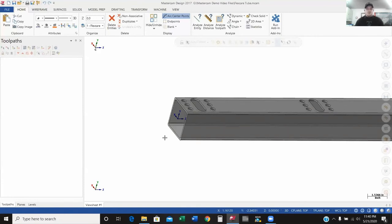Is that always the best thing to do? Maybe not — every situation varies. But if you can locate your X and Y axis in the same spot, it really cuts down on setup time. Most of you know that when you run multiple parts, the thing that takes the longest is normally your setup — tearing down vices, loading vices, loading different tooling. So cutting down on that process as much as possible is really helpful, and you can use your programming to help with that.